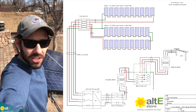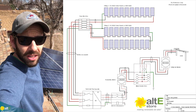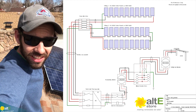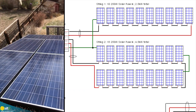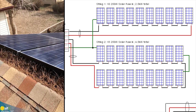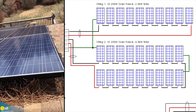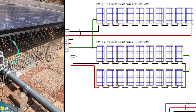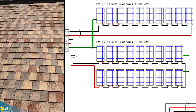We're up on the roof now and we're going to take a look at the two solar arrays. When you're on the roof you should of course be wearing fall protection equipment, but for today we'll file that under the 'do as I say not as I do' category. Here we've got the east-facing array — 10 of the 250-watt panels for a total of 2.5 kilowatts. You can see the squirrel guard doing excellent work on these pine needles. Here's where string 1 outputs with the grounding wire in green, heading into this conduit.